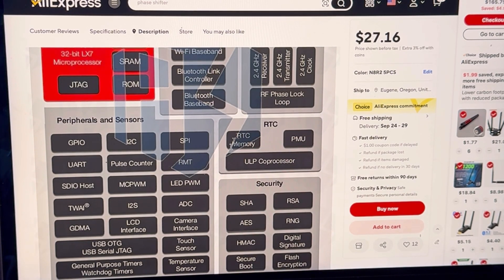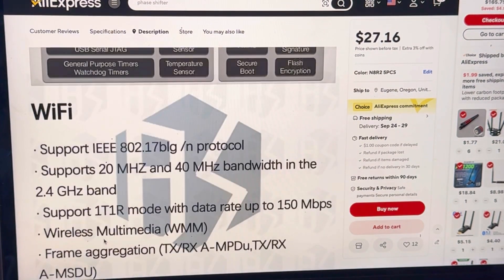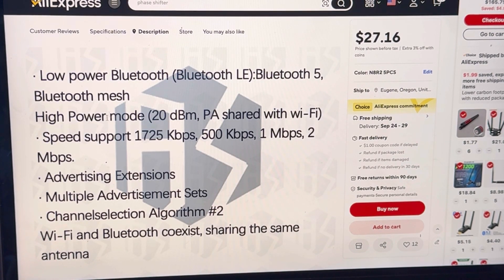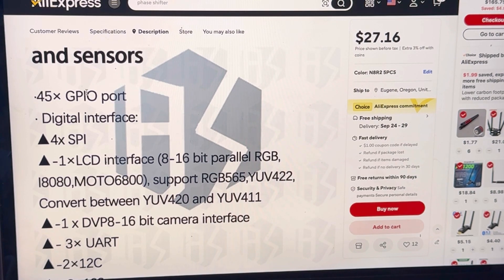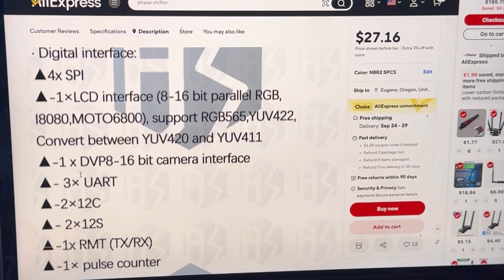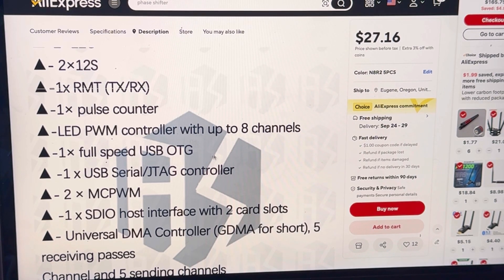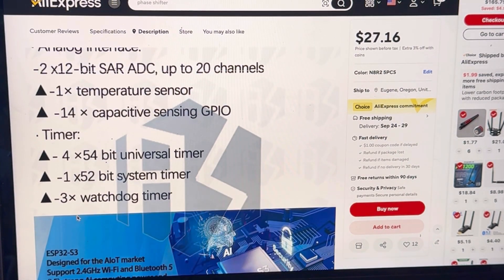Overall it also has touch sensors, a temperature sensor, USB OTG, USB-C for powering things and serial communication, RTC, and tons of security features because it has RF. It has Wi-Fi, Bluetooth, and a dual-core processor. It supports four different ways to connect via SPI, three different UARTs, I2C, and I2S — even a USB JTAG controller. The built-in temperature sensor and RTC make it a no-brainer.